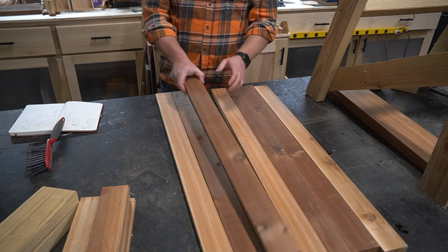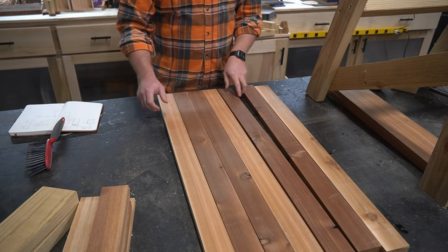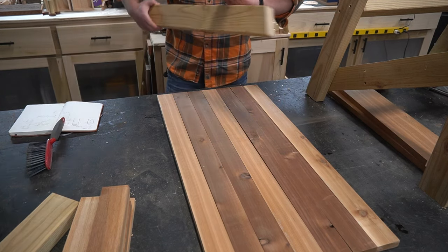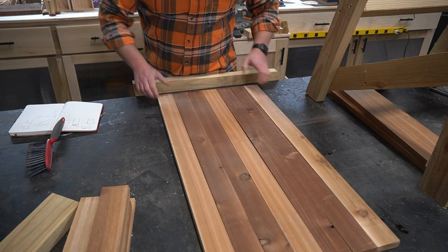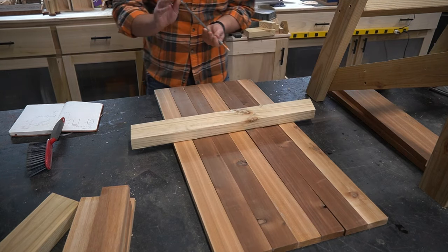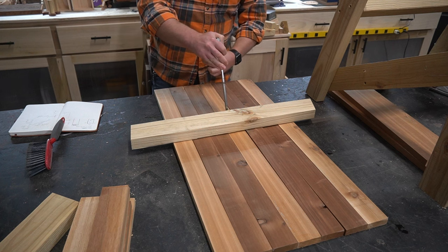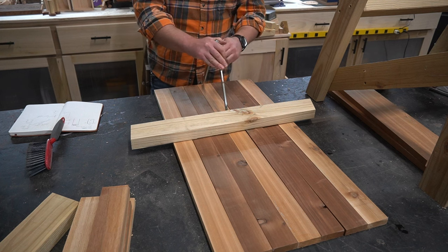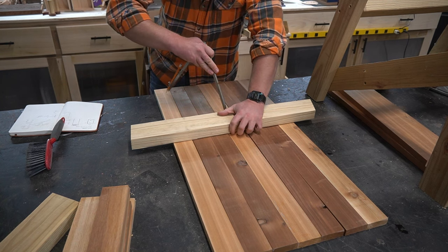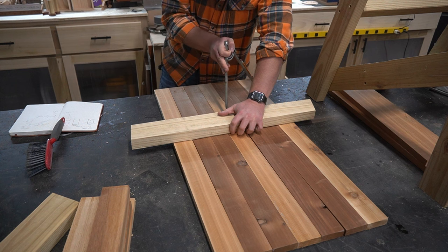Since the back is the focal point of the chair, take a minute to find the most attractive layout both in wood grain and in symmetry. I use a scrap 2x4 and the straight edge of the table to make sure the back slats are all even before I use the compass to draw the arch. If you're making more than one chair, lock that compass or document the angle so you can save time later and ensure they all have the same arch — everyone who steps into the yard will notice if they're different.